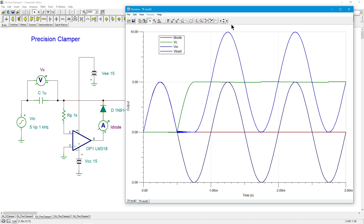Once we get past the first cycle, you can see that we have success — I have this whole signal shifted up by the peak value. But what's happening up front is kind of interesting. On the first half positive cycle, the input and the output are going to be tracking each other perfectly. The funny thing happens when that input starts to go negative — we start to see the diode turning on, charging up the cap. The green is the capacitor — you can see that thing starting to charge up. Eventually when it gets up to its maximum value, which would be the negative peak, the KVL has got to work, so this has got to match whatever the input negative swing is.